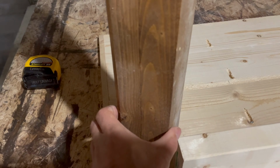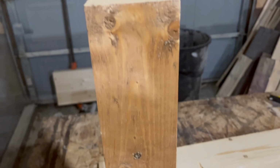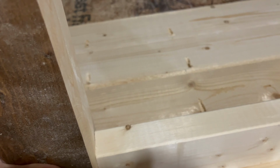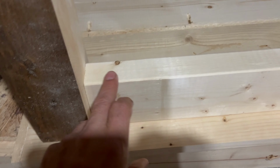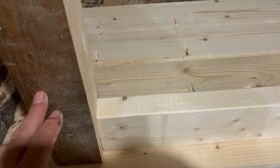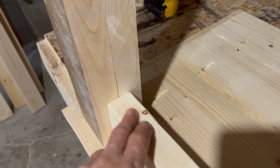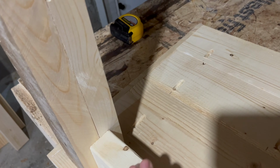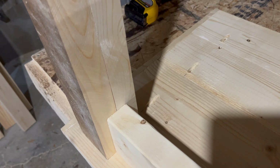Take up my mock-up practice leg, which I've already done. This is just in the rough, like I say, just a rough cut leg that I've done for practice. But I am going to inset this maybe about halfway down the 2x4, which I'm going to mill down. And I think that's going to be a pretty darn good apron that's going to go around here. Then it'll just attach from this end, attach from the other end halfway down. I'll come across here and make it really reinforced. I might even make the leg detachable.